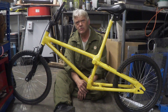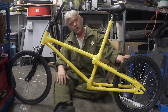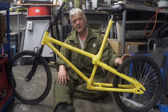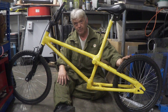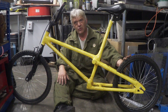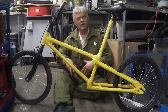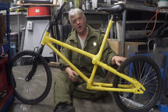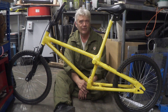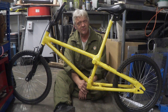One more point that came up in the comments: the drive cog at the back needs to have spaces between the cog and the wheel to avoid the belt fouling the tire. I did mention in the original video that I put nuts in there to act as spacers, but if that wasn't picked up it clearly wasn't emphasized enough. That back drive cog does need to sit a little bit away from the wheel to stop the tire fouling the drive belt.